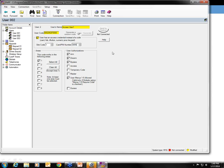We'll just say 8855. You can't go above 65535 on 5-digit numbers, but at any rate, you see how when I've entered this information in, I now have this rather odd-looking hex representation of that data, and that's how the users are stored in the M1. So you can use the ElkRP software to set those up relatively easily.